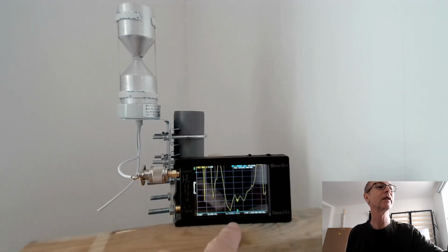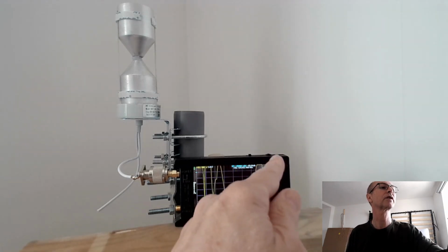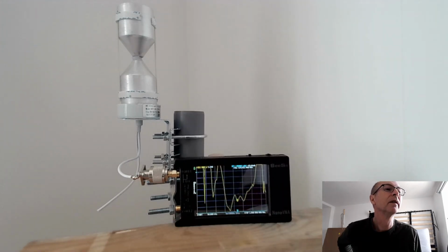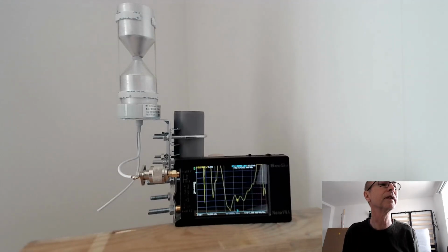And then the frequency that I'm interested in, which is 870 megahertz, the SWR is about 3 to 1, which is a bit high. It's okay for receive, just for listening around, but it's not ideal for transmitting. So it's about 3 to 1. And then it goes on up to nasty, just up there. And at 1 gigahertz roughly, there's a bit of a nicer match as well. So it's, yeah, it's not ideal, but I didn't expect it to be ideal. I didn't even think it would work at all.